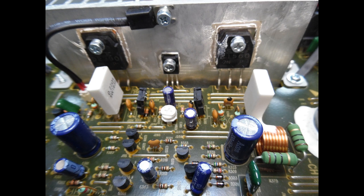Then performing the same test but now measuring on the left channel - as soon as the power relay energized, it was probably about 1.3 to 1.4 volts. That is more than enough to trigger the protection circuit, and as soon as protection comes in it de-energizes. So I needed to make a couple more tests.